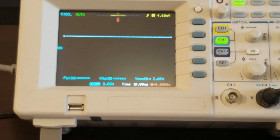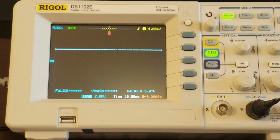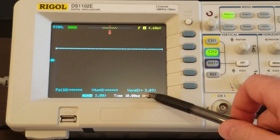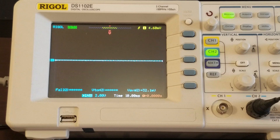I have attached my GPIO pin to the oscilloscope, and you can see here the voltage reading when the button is not being pressed. The average voltage value is 3.07 volts — approximately equal to 3.3 volts from the power supply. If I press the switch, my voltage goes to approximately 3.1 millivolts — that is, the logical 0.